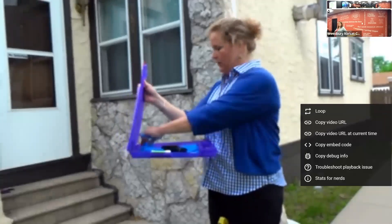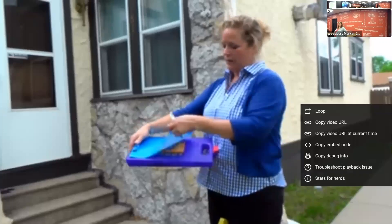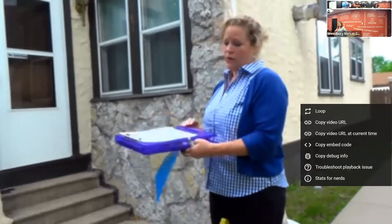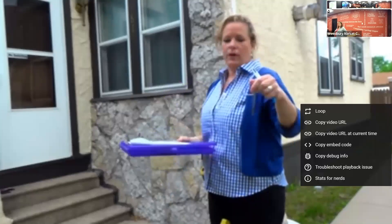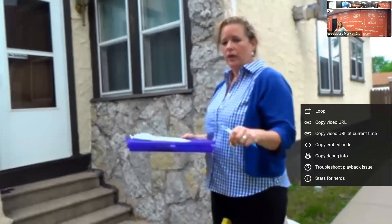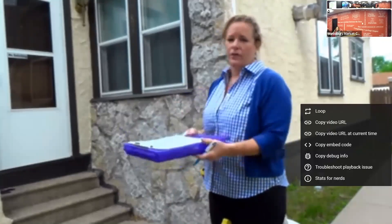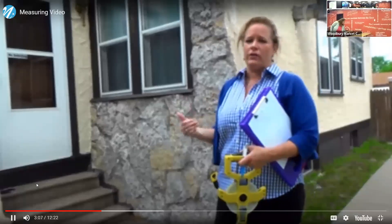Inside my clipboard I have a flashlight for vacant rooms, and a laser measure I can use inside. In the rain, you can slide a cover over to keep your paper dry. Once your paper gets wet, the pen won't write anymore — in rain and snow, wear a big coat with a hood. I also have a piece of metal you can stick into the ground to anchor the tape when you can't get up close to the house due to bushes or a steep hill. I usually start at the front corner — if the house has a garage, I start there. Work out whatever system works for you so you don't miss anything.